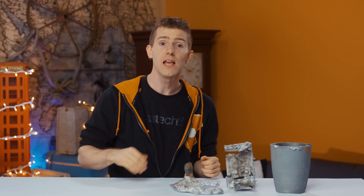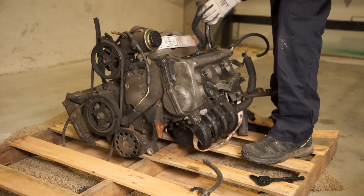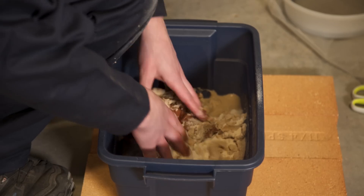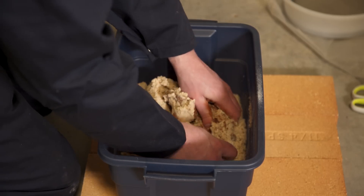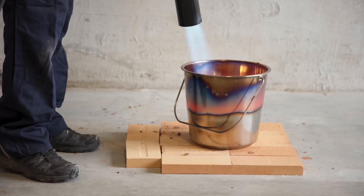To improve our odds of success we needed casting grade aluminum, but buying that stuff new is pretty expensive. Fortunately, there's a large source of casting grade aluminum: the scrap yard. So we headed there and picked out our victim — extracting the engine out of a 2002 Toyota Yaris. Back in the shop we took apart the engine, cleaned off the dirt, and chopped it into pieces small enough to melt. We then used foam to extend our pouring and venting holes, mixed up clay, sand, and water until it reached a pliable but shape-holding consistency — this mixture is called green sand — packed it around the 3D print, and baked it for a couple of minutes to partially melt the plastic and harden the clay. This whole process is called lost PLA casting.